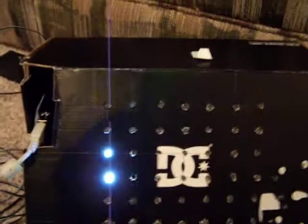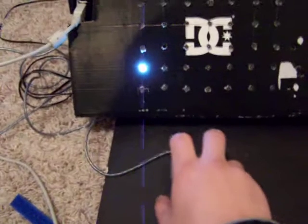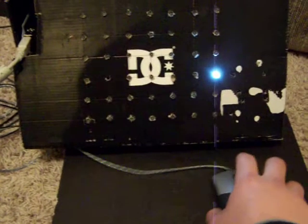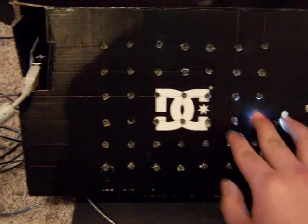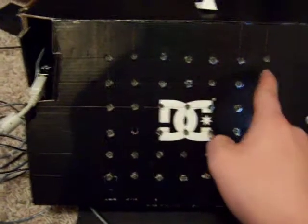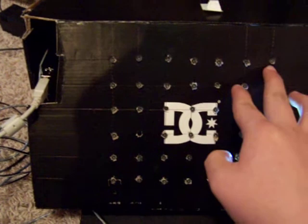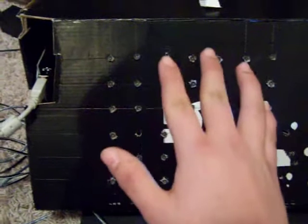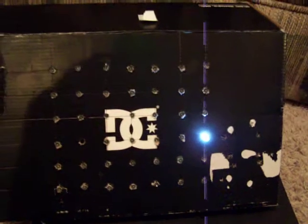What's unique about this navigation program is that once I get to an edge, it stops. So I can keep moving left and it's not going to go left. I can go all the way to the right and keep moving right — it's not going to keep moving right. It doesn't sound like much, but the way the microcontroller understands things is that these are all just numbers. So when I get to number 6 here, and this is 7, it doesn't know it's supposed to stop at 6. I programmed it to work on any size matrix that you can fit on your board.